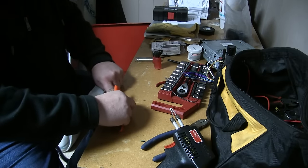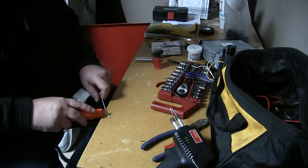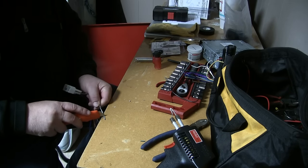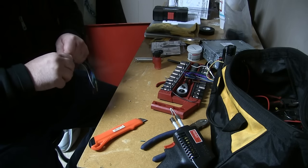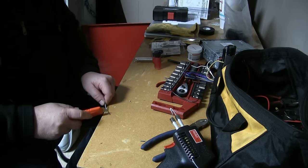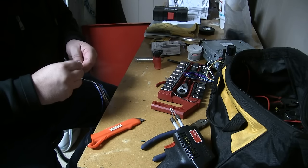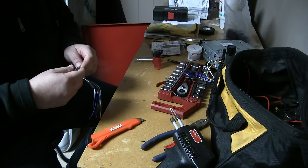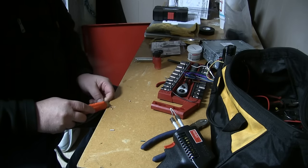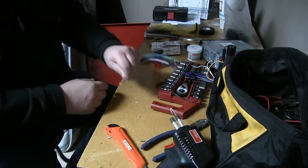Now, I'm not gonna claim that I'm someone that solders every day, but I'm gonna show you how to solder a wire together. I was doing this at home and didn't bring all my tools. A wire stripper works a lot better than doing it this way, because you don't want to cut any of the wire. So if you've got a wire stripper, I really would recommend that, but you can do it with a razor knife the way I'm doing it. Just be careful not to cut any of the wires when you're taking the insulation off. I just kind of roll it around just to cut the plastic enough where I can slip that off.